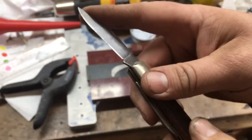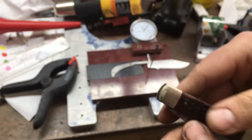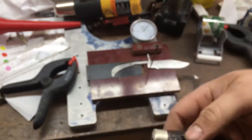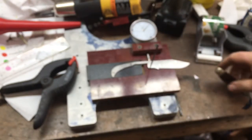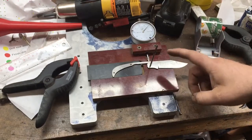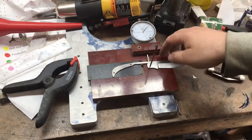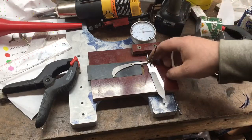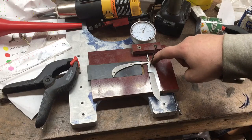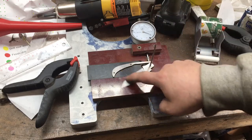How custom makers do that without going crazy putting it together and taking it apart a thousand times and making really small adjustments — you can get there a little bit easier and more quickly with a rise and fall indicator, which will kind of simulate a constructed slip joint and let you see where that back spring is going to end up when you're in those three positions.